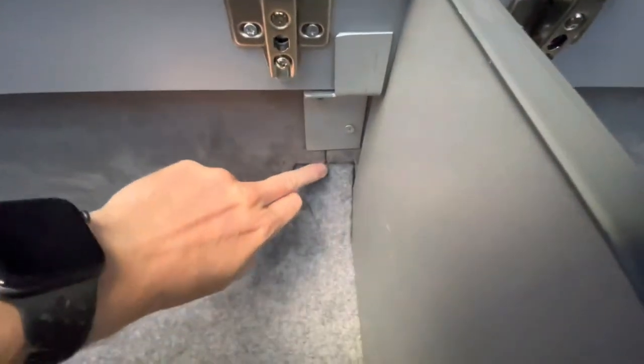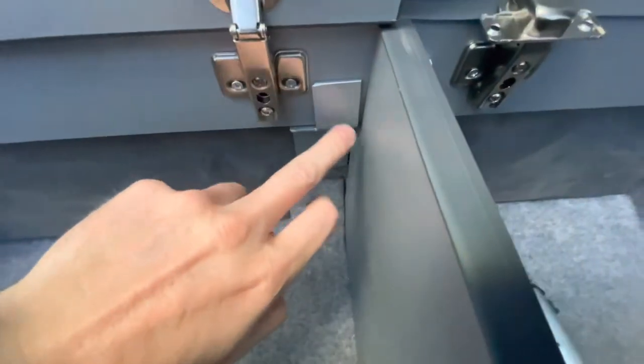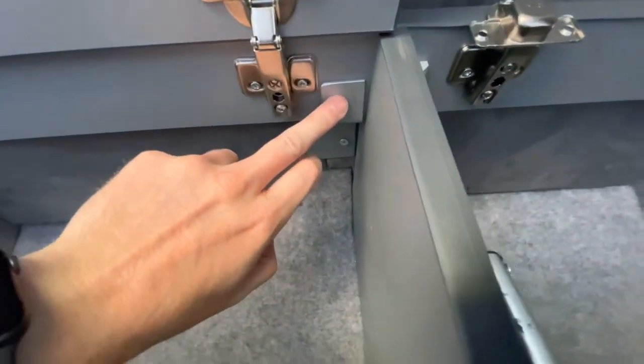We've screwed into that cross beam and I'll put a screw through into the wood just to hold it. On the backs are the L brackets supplied with the kit — I've put two in each locker against the lower rib. You've got the void here, metal either side of that, and metal from there down, so two in each locker. I've also recessed one hole and put a tech screw straight through and into that corner rib piece.